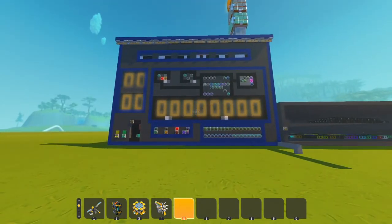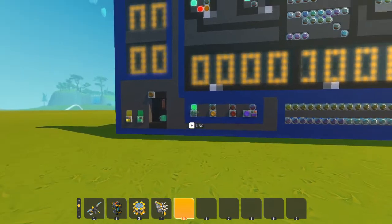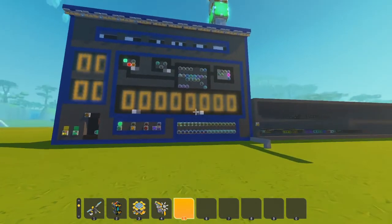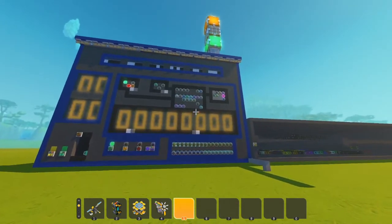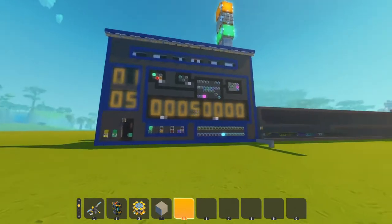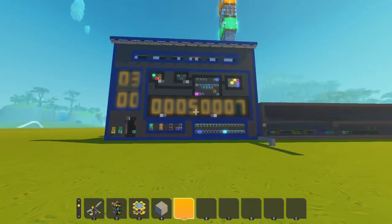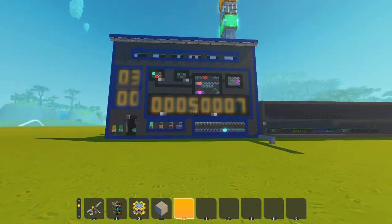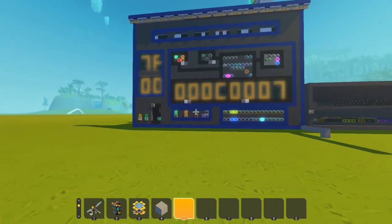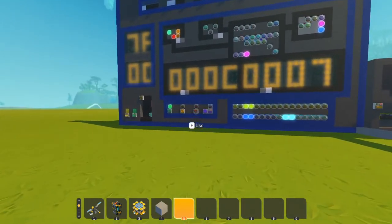We have to program the computer because if we ran it now it would not work. I've programmed a simple 5 plus 7 addition. If I press the green button it should turn on — we should see the RAM go on. Yes, it actually reads the color card and puts it in the RAM. Now it's working and we should see the clock turn on. We can see it run — it has loaded 5 into register A, now it loads 7 into register B, and next it should add those two together. And we see C, which is the hex equivalent of 12. So it actually works! Now it has run out and nothing is there, so it begins to do weird stuff.